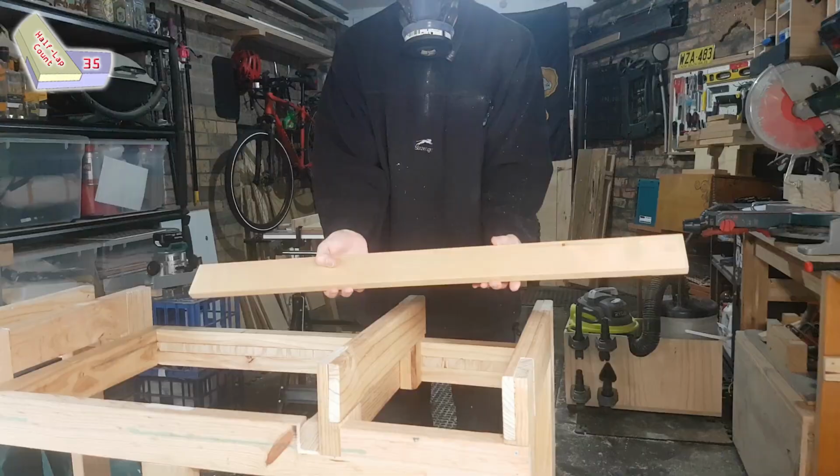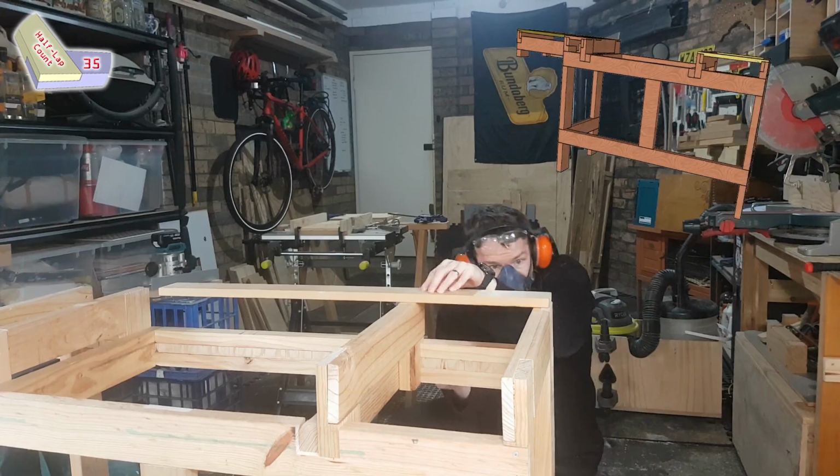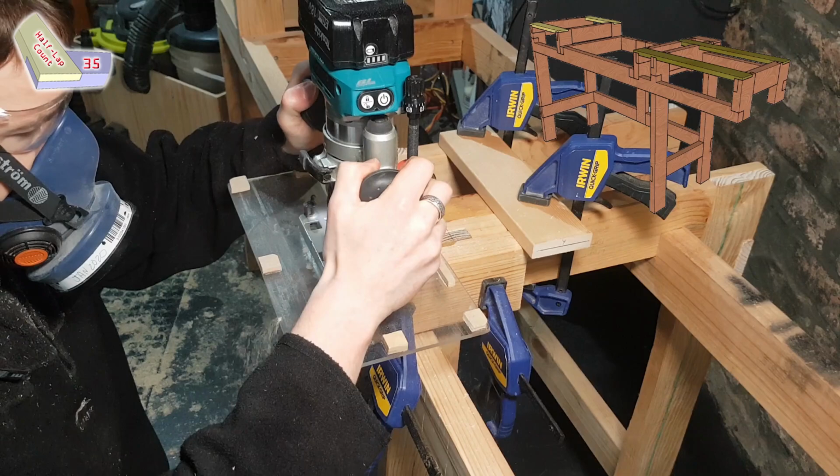These are still bed slats, they're just a little bit thinner, only 19mm, the rest of the stock had been 90 by 35, and I've found out another way to cut half laps, this time using the plunge router. A few little supports clamped on there, and it made quick work of the 10 half laps for these drawer tops to fit over.